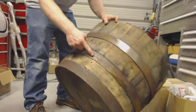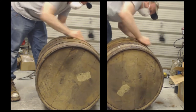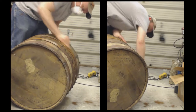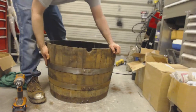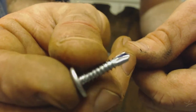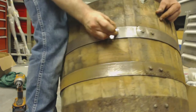Now unfortunately that means I've got to continue sanding. So after we have all the metal bands nicely sanded, we're going to use these three-quarter inch self-tapper screws to secure the panels to the metal band. Using self-tappers avoids drilling the metal plate and then putting a wood screw in, so we're reducing the step from two steps down to one.